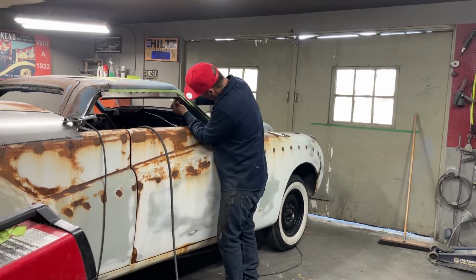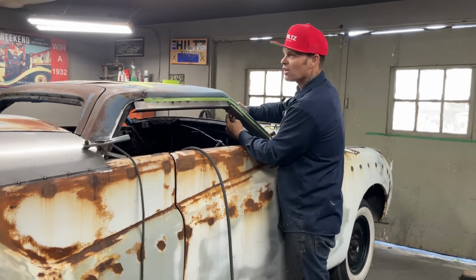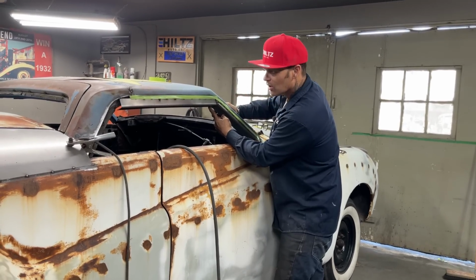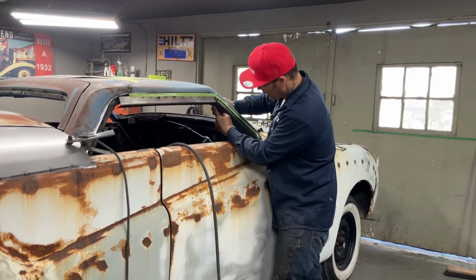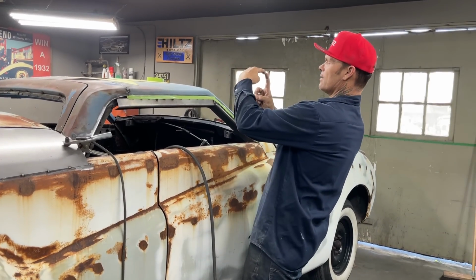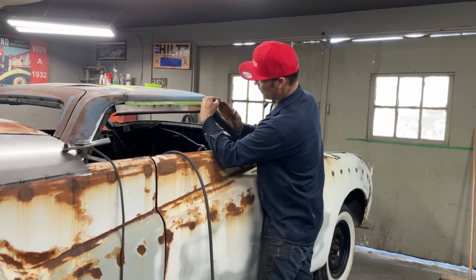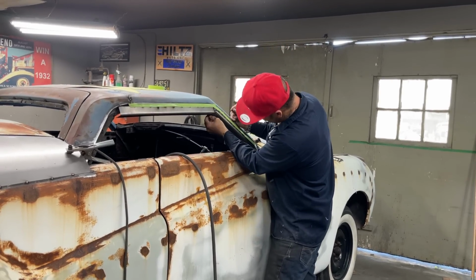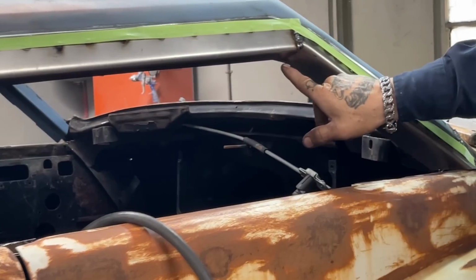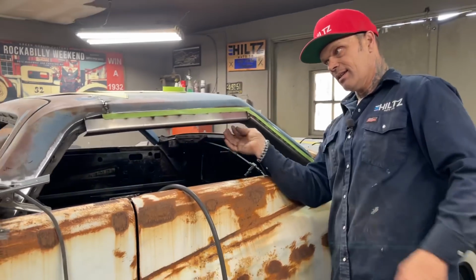And basically what I think is happening on that corner is where I'm getting my problem. When I go in the inside of this car, I think the metal's hitting right here at this corner and hitting at that corner, which is not allowing everything to go in place, and I'm going to have to go in there with a zip cut and where that piece comes down around like this. My corner's going in and hitting that because it's not coming up to a sharp 45 on what I'm making there. It's round there. I can see the lip. There's a little lip hanging out right here, and it's where it's round. It's where it's holding my metal down, and I'm going to cut that and let that go up where it's supposed to.